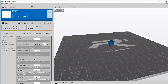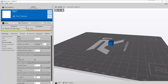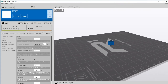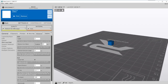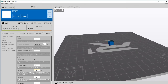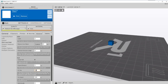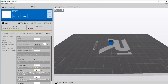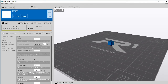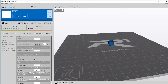So because of that we're going to play with this setting. We are going to try three different things. We're going to print one model at standard settings, and as soon as it finishes printing I'm going to try and remove the model from the raft while it's still hot — while the build plate is still hot, as quickly as possible. Then we're going to come back and change this setting to 3 and then 4, and print those. By creating a bigger air gap, the piece shouldn't hold as firmly. But we don't want it so loose that it messes up the first layer or that the piece just falls off. We'll do all three prints and I'm going to show you all three at once, then we'll go through removing the rafts on them. So let's get the printer heated up and get started.